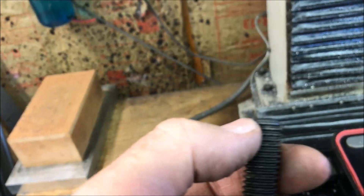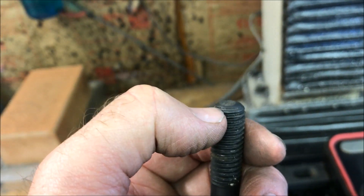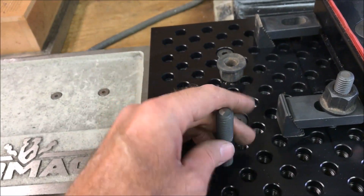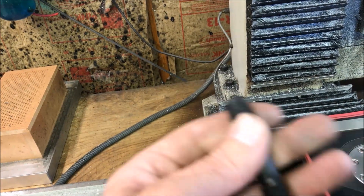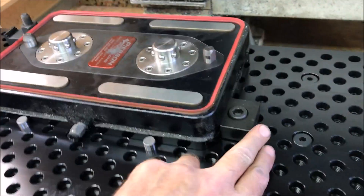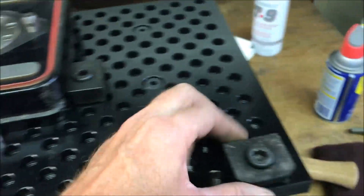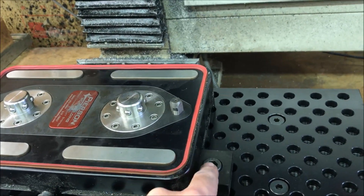These bolts come with a large rounded tip, and when I'm trying to get the most threads into this fixture plate it hits the bottom and keeps it from getting more threads in there. So I typically just grind that off — on a regular bench grinder these things grind off within seconds, it's really easy. I'm actually shaving down the bolts for these here also so you don't hit the table.